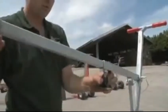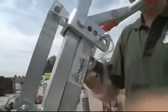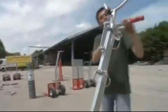In order to adjust the length of the trunk holder, first of all the star screw is loosened and the trunk holder is brought to the desired position. Then the screw is tightened. When the trunk holder is not required, it may be fixed in a rest position to save space. For this purpose, the pin at the adjusting strip is removed, the bracket is moved upwards and refastened in this position. For the protection of the trunks, the fork of the trunk holder should be wrapped with jute.